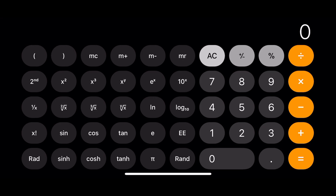Let me show you how to do the math in any calculator. First we need to make sure the calculator memory is clear to ensure accurate results. We do that by pressing memory recall, usually labeled MR. After that we press memory clear, usually labeled MC. Now we're ready to do the math needed to get our diagonal dimension. We're going to do all of our math in feet. To convert inches to decimal, all you have to do is divide the inches by 12. The reason we divide by 12 is because there are 12 inches in one foot.